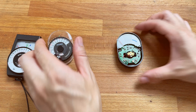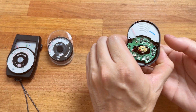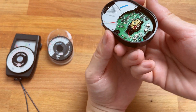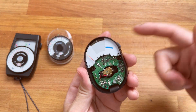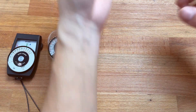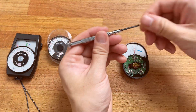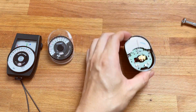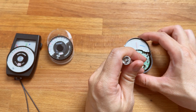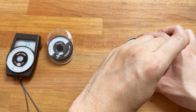We're going to remove the top again — you don't have to worry about the top. You need a reliable light source and a reliable background. I'm using the white wall over there. I'm going to point to the white wall and hit the measurement button — it's going to bring up the needle. As you can see right now the needle is over the dot. Now it's time to use a slotted screwdriver. The meter only comes up for about 10 seconds, so you have to do this quick. Use the slotted screwdriver to adjust the VR1 and turn it.